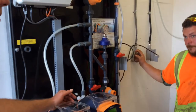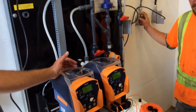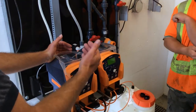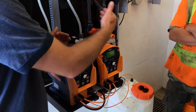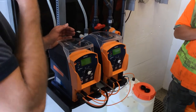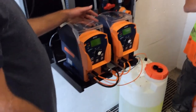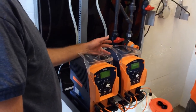But if you want to do good maintenance, I would say somewhere around 2 years, because the way that this thing operates is, well turns on, this guy runs. Well turns on, this guy runs. So they're alternating on the pump to start up. Sometimes I like that, sometimes I don't, because if I have equal time on both pumps, what happens? One breaks, the other one breaks.